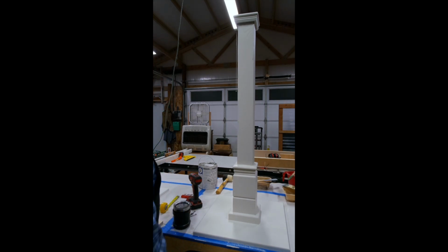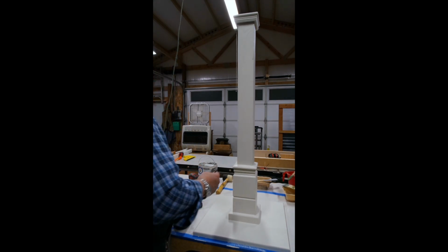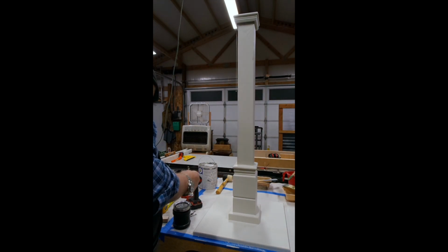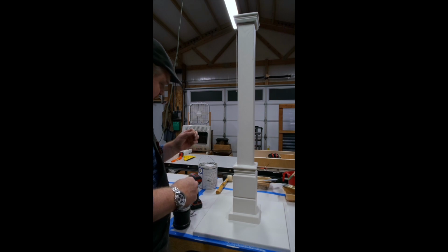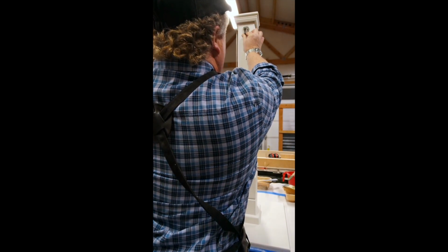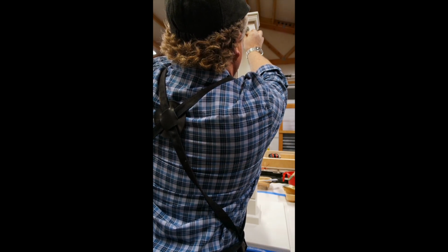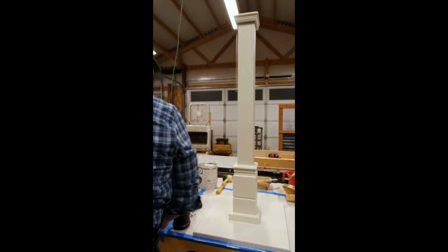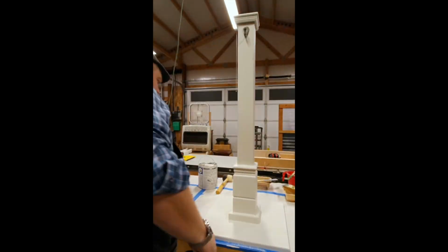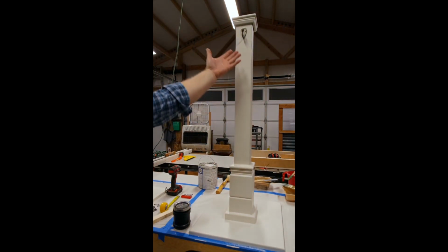So what I'm going to do today is, since the paint's all dry, and it looks just fine to me, we are going to put the hooks on. So I came up with the idea of 3/4 of an inch from the top. Found these nice hooks. I'm going to put in some bigger screws, of course, to make it stronger. Why not? To put it up, I'm just going to put a block here, 3/4 of an inch, center it the best I can. Put that puppy in there, and we should be good to go. I can mark this hole. That looks straight to me. A couple little dimples. Voila!